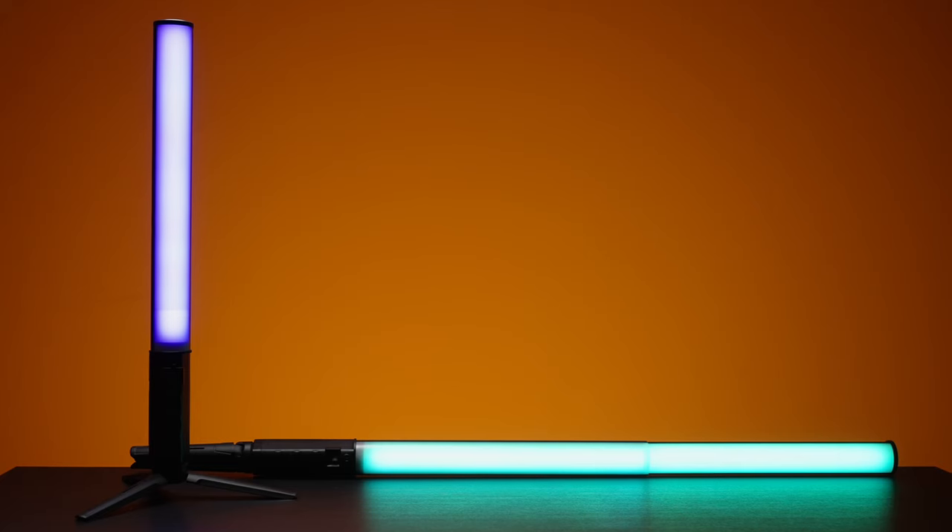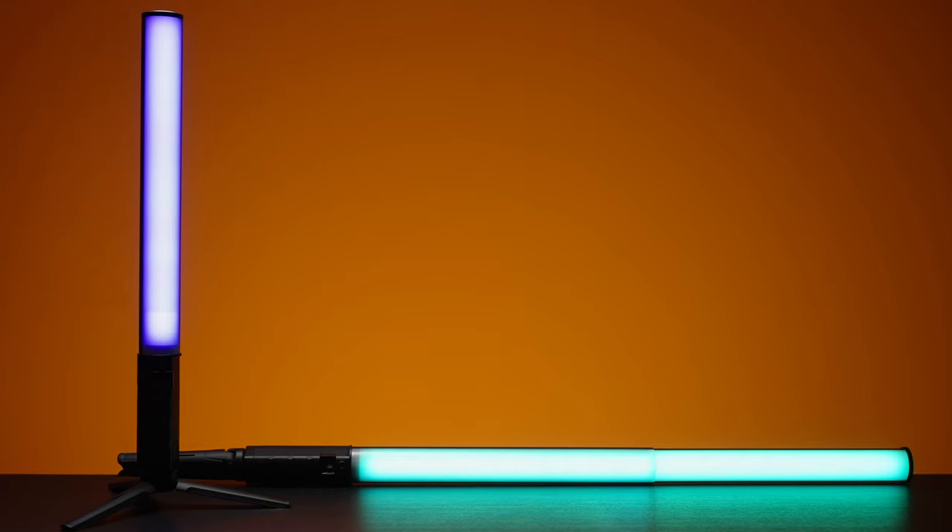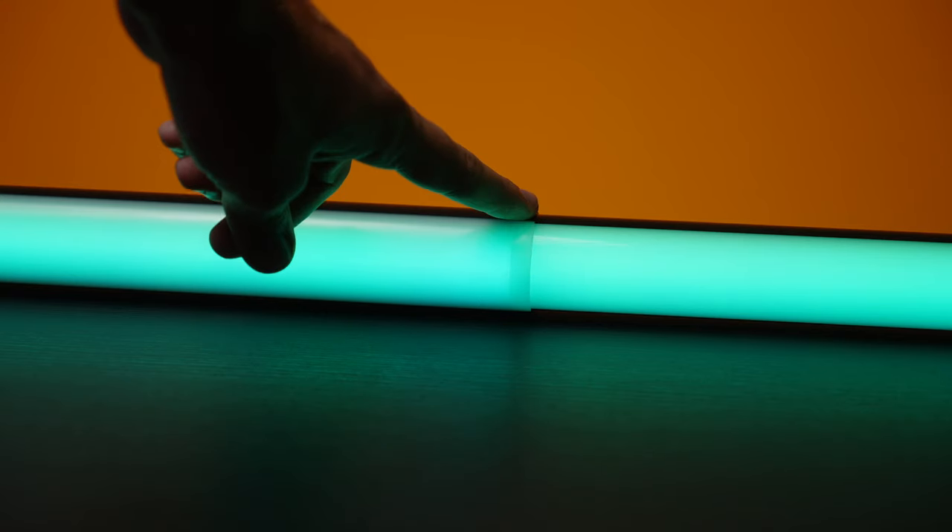The light quality itself is very nice. I like the diffusion layer, and you do get a rather soft light with CRI and TLCI ratings of 97. Also, if the light is in the shot it looks soft as well, but you can see where two sections of the light cross, and on certain brightnesses it might be visible.